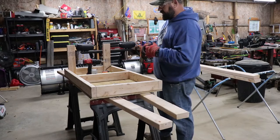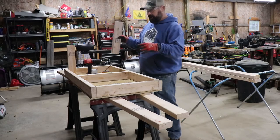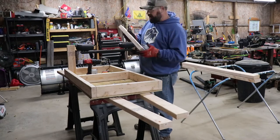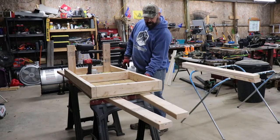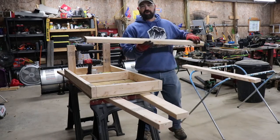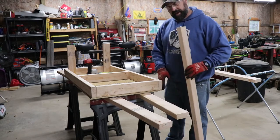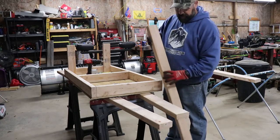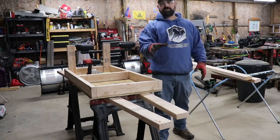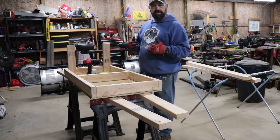The platform is done now and I have it flipped upside down because we're gonna put the legs on. That's what these 16-inch pieces are — we're gonna have it 16 inches off the ground. Technically 16 and a half because they're gonna go to the bottom of the plywood, which is a half inch. The front legs are going to be a little bit different — those are your other four-footers that I cut. They're going to be in the front here, mounted all the way to the edge, and they're gonna be the same length up here, but you're gonna need this part on the top because that's where they put their heads through, where we're gonna set up their feeders so they can't back out.